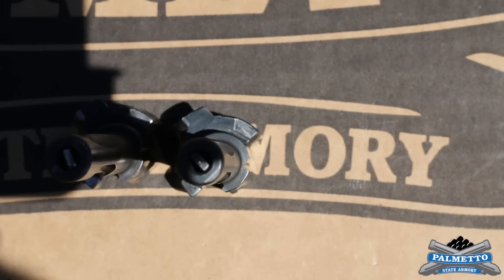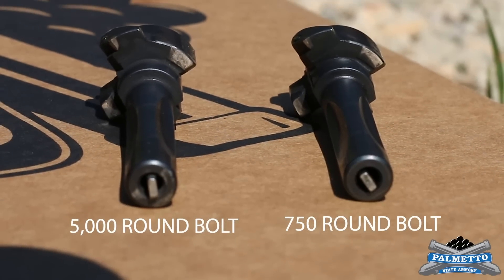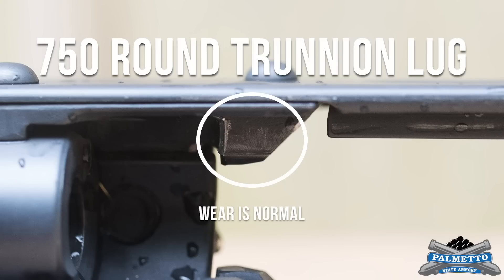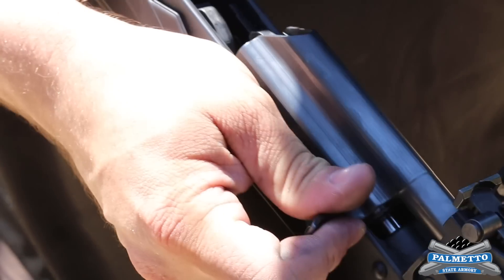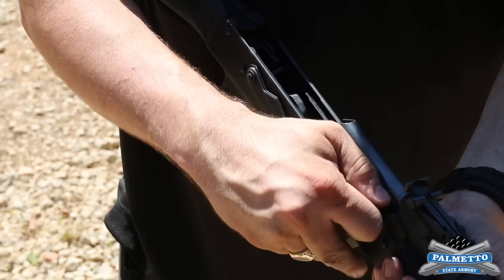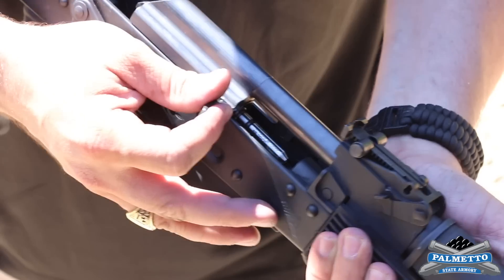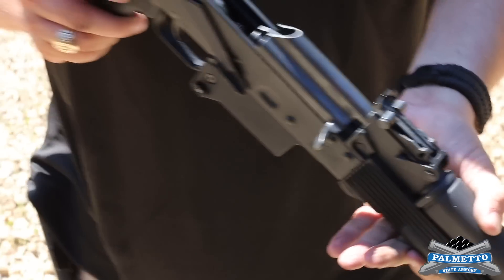Here are your bolts at 750 rounds — 750 on the right, 5,000 on the left. So this is the five gauge we had last time; it barely wouldn't close, but with enough force after that it's polishing in and settling that last bit — it will now close tightly on a five. Here we have a six gauge — not even close, won't close on a six.